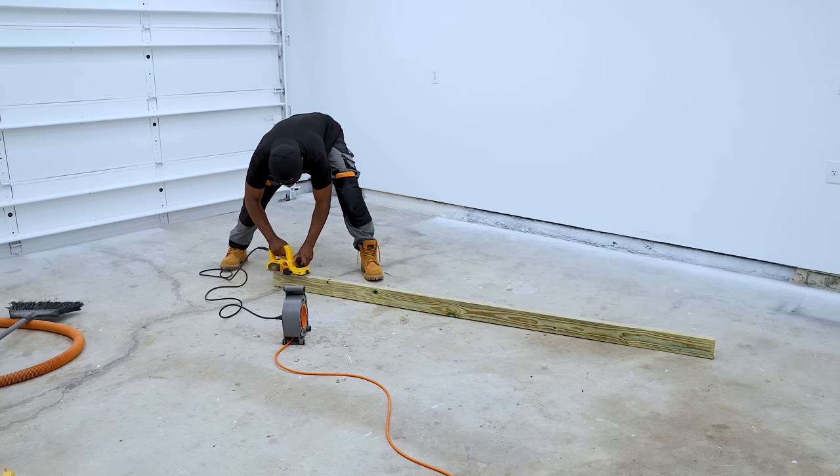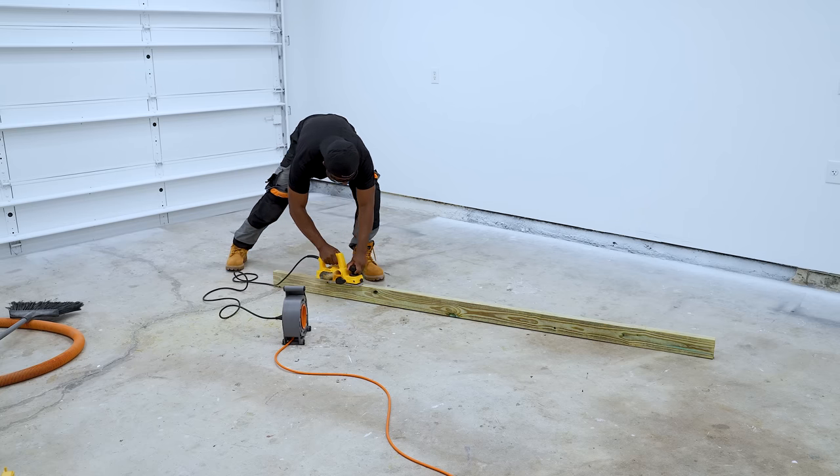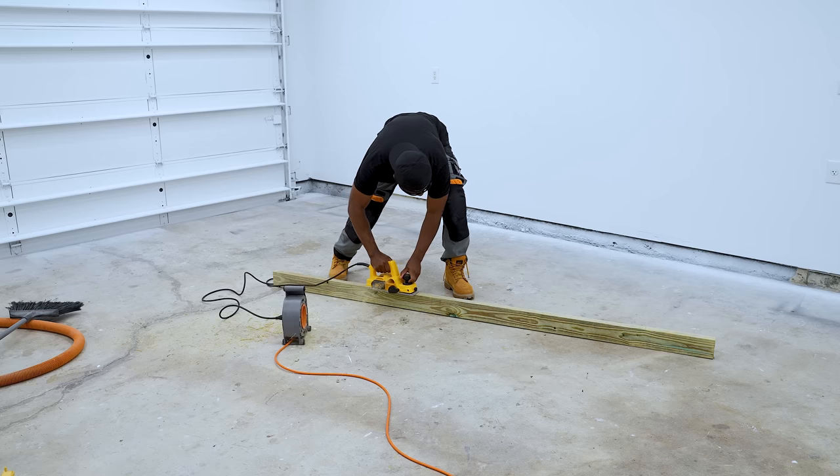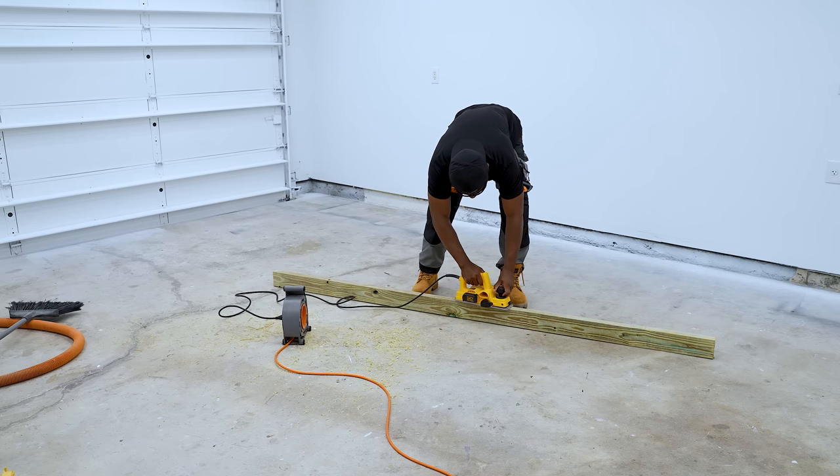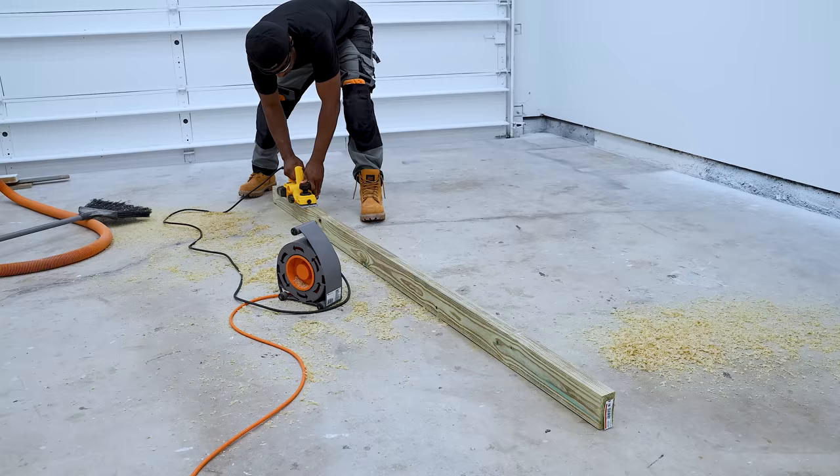As is, I won't be able to place the two by four directly under the doorway and the drywall. I'll need to remove some of the material on both sides so that the height of the two by four does fit tightly under the threshold.